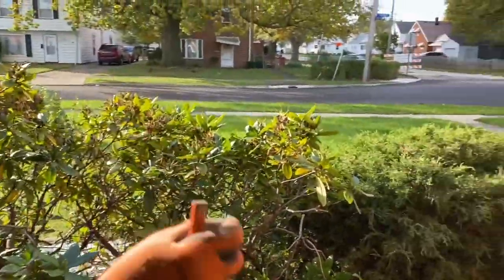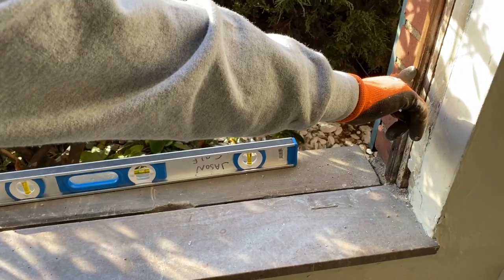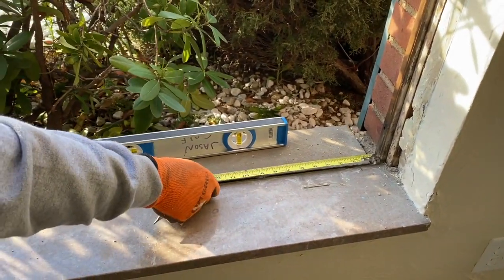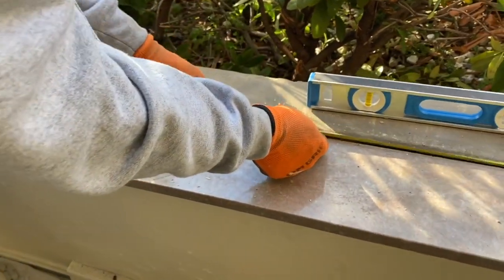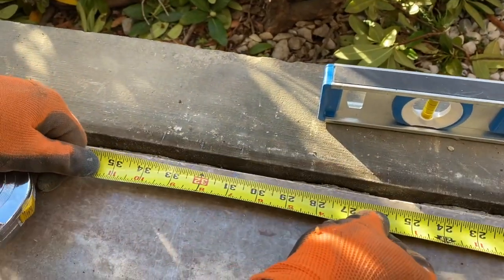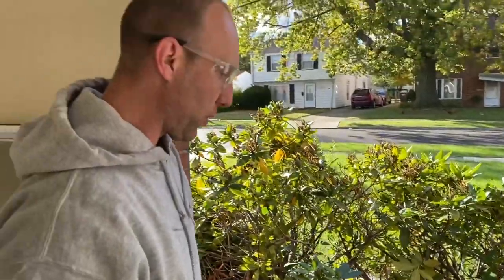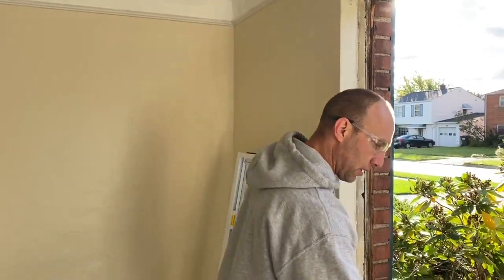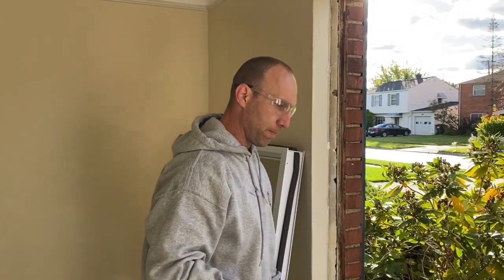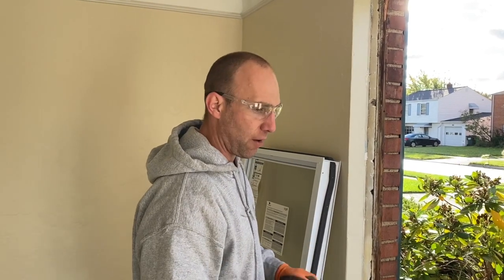Based on our window width of 30 and three quarters, what we've come up with is if we put a two-by-four on this side — which is an inch and a half — and if we put a double two-by-four centered right on our center line, that gives us about 31 inches, which should be plenty of room to fit that replacement window in. Both sides will be like that: a two-by-four on each side and a double post two-by-four in the center. For the height, we'll probably end up building a sill down here, and we can finish that off. But that's basically how we laid this window out, and we're going to go about framing it in.